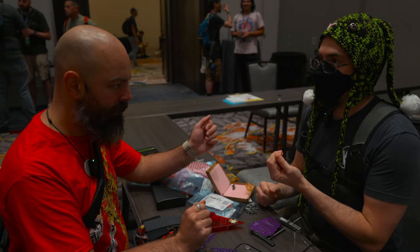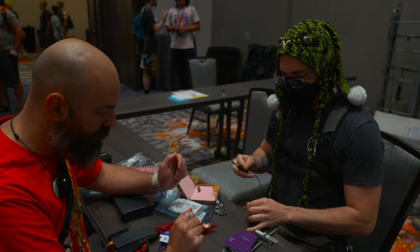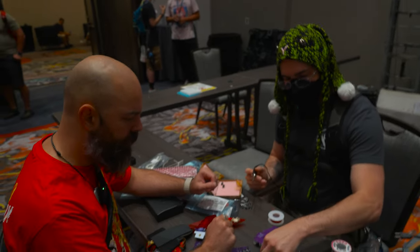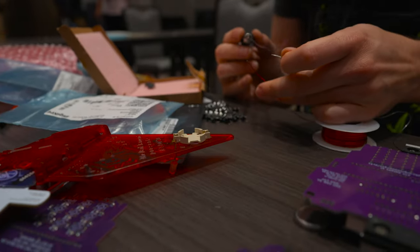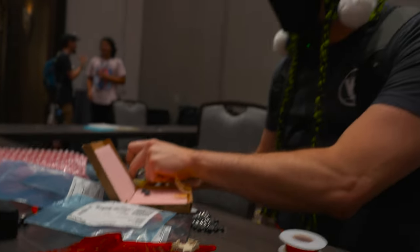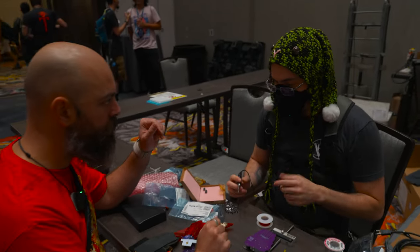Magnet wire. You know what magnet wire is? It's enamel coated, so it's basically not conductive in this state, but there's not a separate plasticized sheath on it. The way you remove it is you just melt a little bit off. Magnet wire is traditionally used for motor windings — if you ever open a transformer or a motor, it'll have a whole bunch of wires running around, and those are all enamel coated wires.